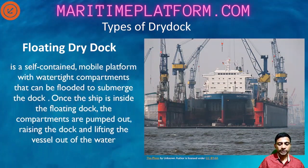The floating dry dock - if you see the diagram, it is very clear where there is a platform which is floating and in between there is a ship station. The platform itself has ballast tanks which are filled up to sink the platform below the water line. Once the bottom platform is sunk below the water, the ship is floated into the dry dock and then the water is pumped out from the platform so that the platform rises and the ship sits on the platform. This dry dock itself can be moved from place to place, making it mobile. That makes it easier for ships to approach the dry dock, and if there is a business or environmental change, the dry dock can be shifted to another location.